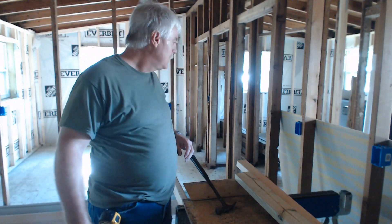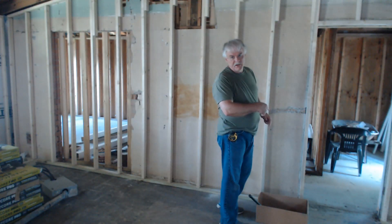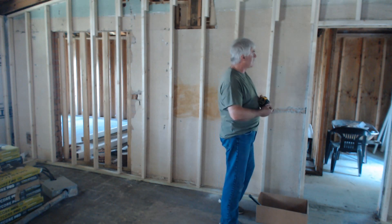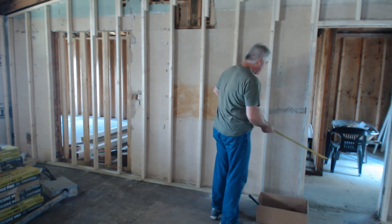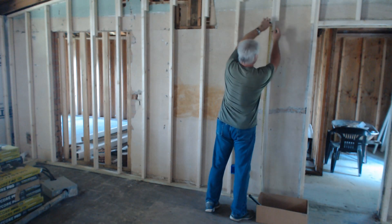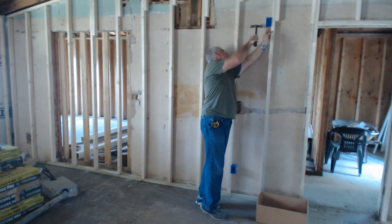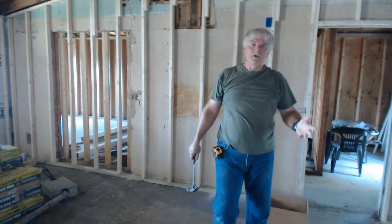That takes care of the kitchen, except for the stove outlet — I don't have that box with me. We'll run the smoke detector at 80 inches to the bottom, so it will catch any smoke that wafts through this doorway. Beyond that door is a bedroom, and you're required to have smoke detectors near entrances to bedrooms — outside and of course inside. So we're going to put it here to catch anything that might go into the hallway, and then we'll put one in the bedroom as well.